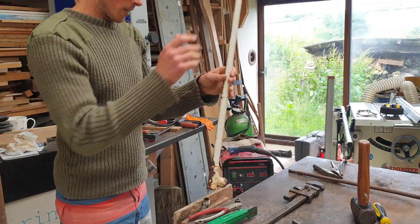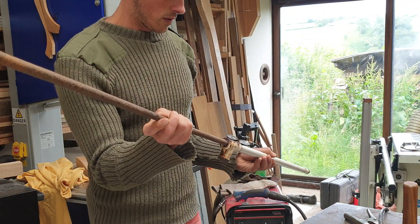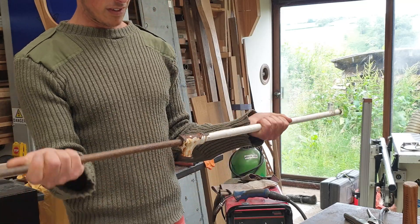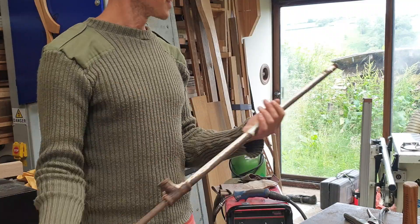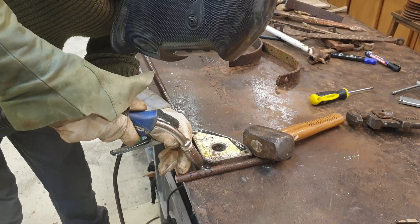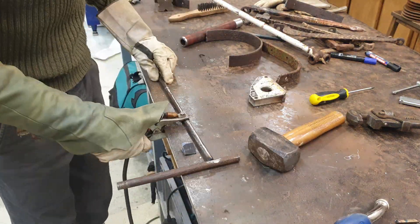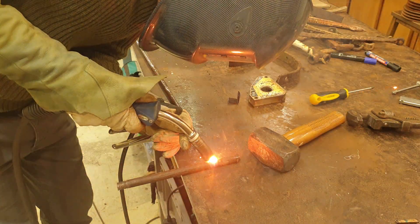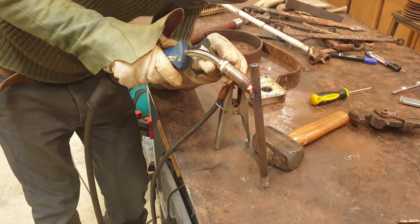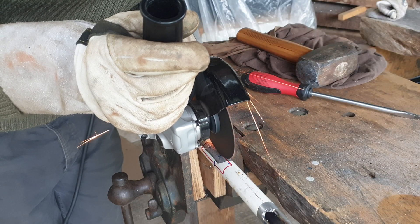The design of these tongs really did evolve out of the junk pile. Here for example we have some scrap pipe and an old shaft. I thought one would rotate inside the other nicely, but not so. It took quite a while trying to work out which one was bent and in the end it turned out to be both. A semi-ridiculous amount of lathe time later, and some bending and settling, and I've got that rotating inside the tube and just welded a handle on there. Now I'm going to modify that outside tube.